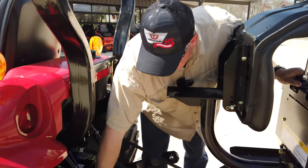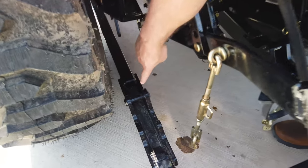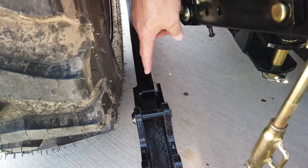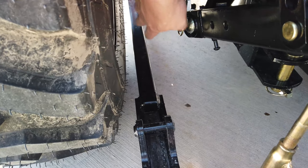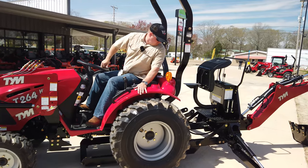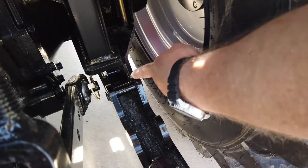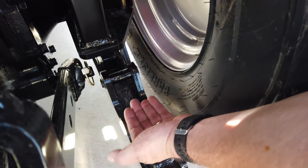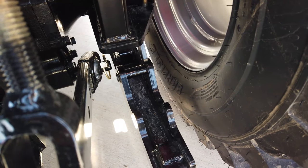The cradle has two hooks under the bottom of the tractor and they're going to go over these pins. We're going to back the hook up until it's right in front of these pins, then use the outriggers and the boom to lift the backhoe frame up to the cradle of the tractor. You're going to back up until this piece of metal is in front of the pin with the hooks behind the pin, then pick the frame up to the cradle and back the tractor into it, both front and rear.